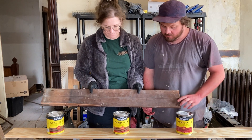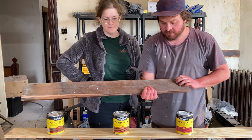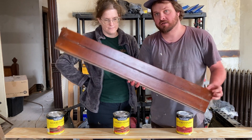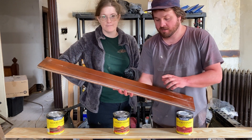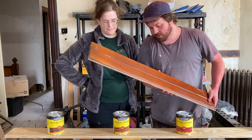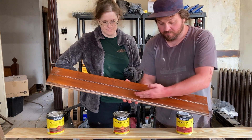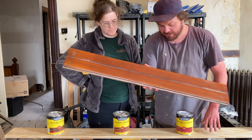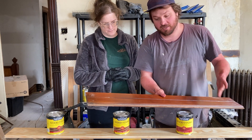The old stuff is obviously a different color. Some of it's just from sheer age — they build up with carbon, get a little darker. You can sand through this layer and get them to be a bit lighter, but this is what we've got for a completed look. This has about five coats of shellac and a coat of Waterlox, which is what I'm using to waterproof everything. The new stuff has very wide growth rings, so the color is going to be lighter.